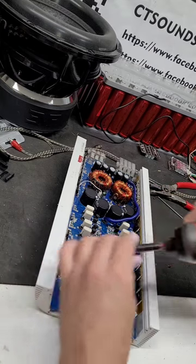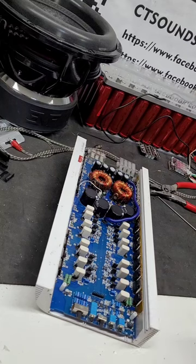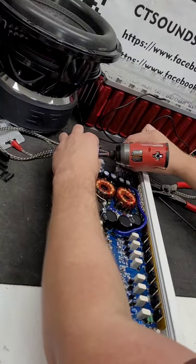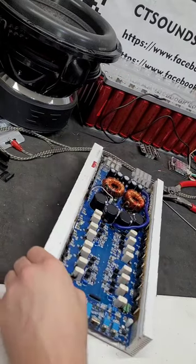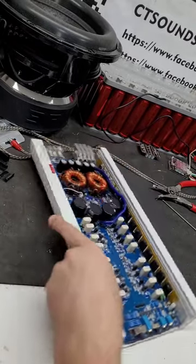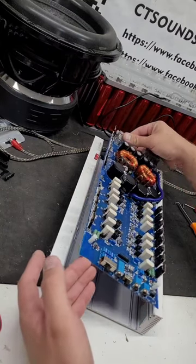To test the first bit, you don't need to pull everything apart. It does help, but when you're putting it back together, you do absolutely need to pull everything apart. It needs to come all the way out. You have to inspect the other side of the board. You don't want to just assume that there's nothing running down there, because you'll have a big blob of solder that's going to short or something else, or worse. One of the cool things about these CT amps is they actually rock in like that.